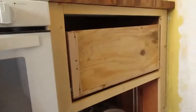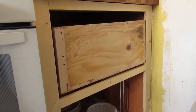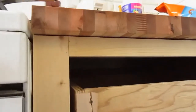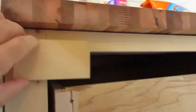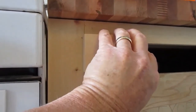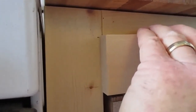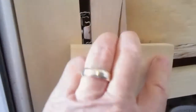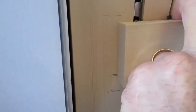Let's come over here to our new cabinet under construction. You can see I've got a shim there for allowing a gap between the box drawer and the face frame. We're going to take a scrap piece of wood and measure off with overlaps in consideration from the countertop. I've got a pencil mark measuring about a quarter of an inch overlap and we're going to have a roughly half inch overlap on the sides. We want to make sure we've got that overlap measured correctly on the bottom as well. Using scrap pieces helps a lot with measuring your overlaps and face frame widths.